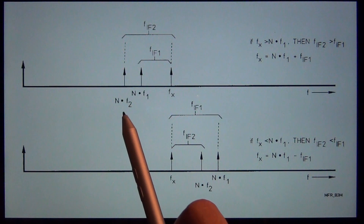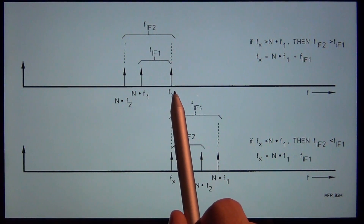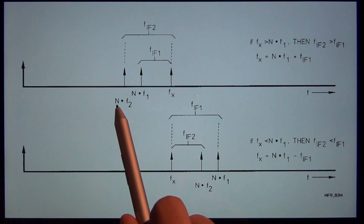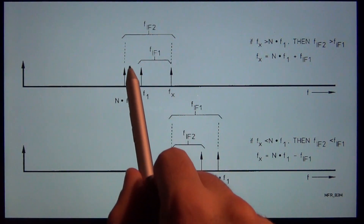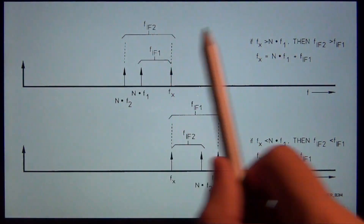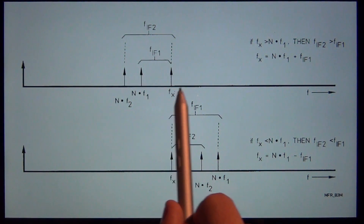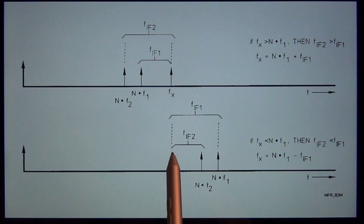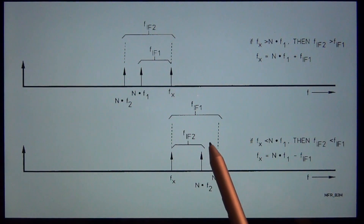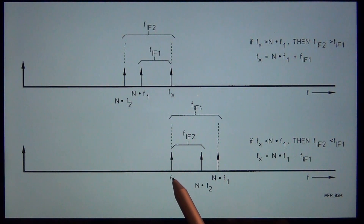The solution is quite smart. I can measure the frequency fx two times: first with n × f1, and then again with n × f2. Measuring with LO frequency f1 produces IF1; measuring with LO frequency f2 produces IF2. Both of these LOs are on the lower sideband and fx is on the upper sideband, so there could be ambiguity. But by going through the equations — by having two LO frequencies whose difference in frequency is known — you can exactly calculate the location of fx and the value of n. n can be calculated as the difference between the IF frequencies divided by the difference between the LO frequencies, rounded to the nearest integer. These slides will be available on my website.